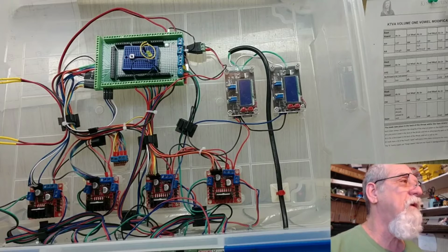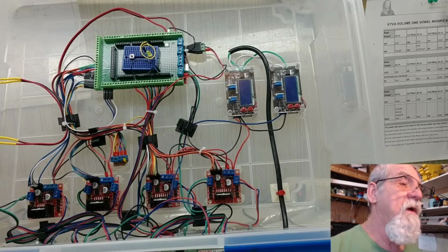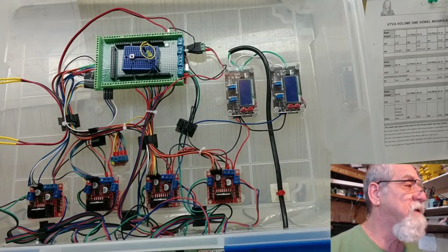That way I can put all kinds of grounds on there. Got a little light there for the on and off. Okay. Right over here are all the motor drives. These are what drives the stepper motors. And what's interesting about this, if you'll see here where the cursor is, that's where I split. For the Y-axis, I've got 2 stepper motors that are running off one signal coming off this board. So right here I split it, and one goes to one drive, one goes to the other.